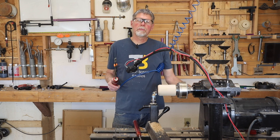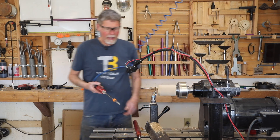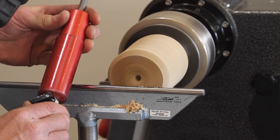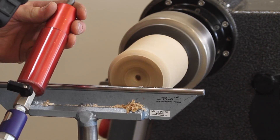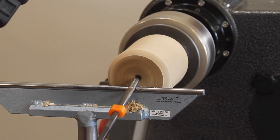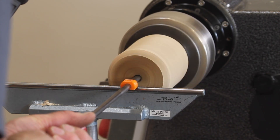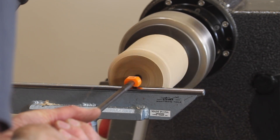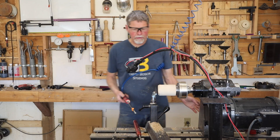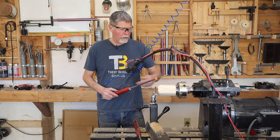When drilling, I generally use a similar speed to what I was turning at, or just a little bit slower. I open the ball valve on the tool just a little bit to get the air flowing and start flushing those shavings out as I drill. I set it in there, open the ball valve, feed it right down to my stopper, turn the air off, pull it out — and now we've drilled a nice, easy, quick hole down to the distance we wanted.